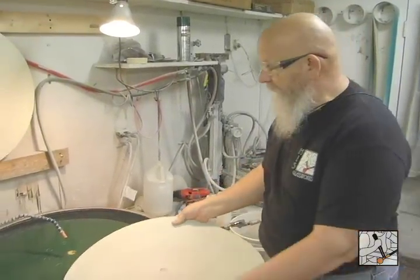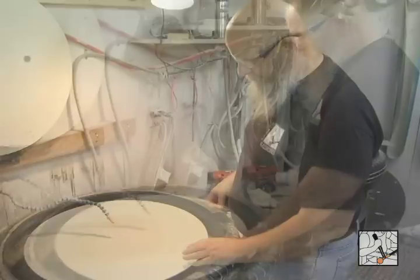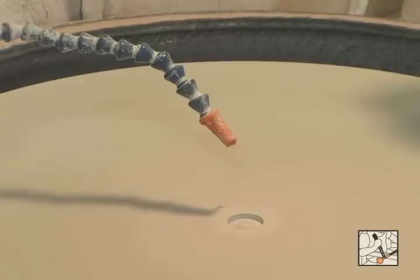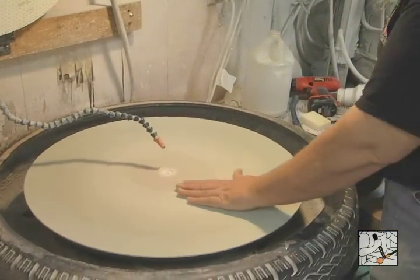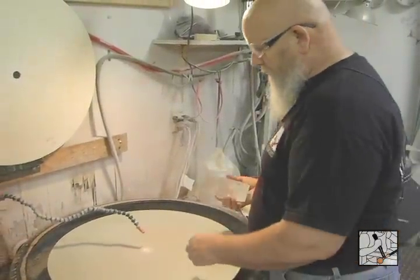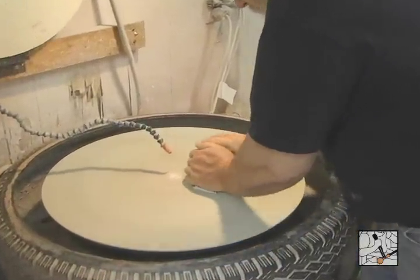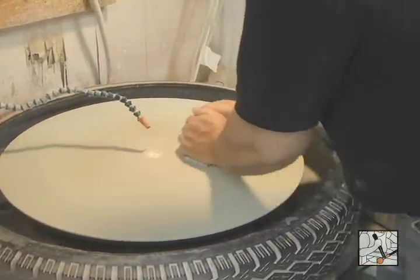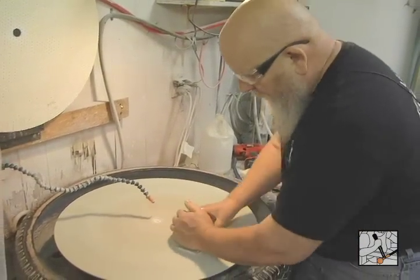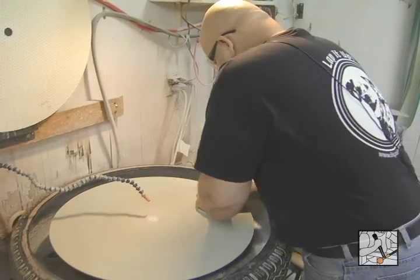This is our LP66 material. You want a little more water — this is the dry pad and it takes a while to absorb water. Once I'm sure it's adequately wet, I'll cut back on the water a little. Shake up the cerium and put a little in the center. It's going to look like most of it washes away, but enough does stay around. My piece of glass is well rinsed. With polishing, you want it going multi-directional — unlike the grinding steps where I was very sensitive to keeping the grinding going in one direction. You'll end up with a much better polish in the long run.